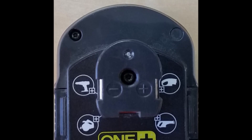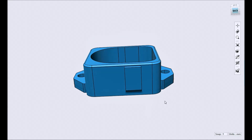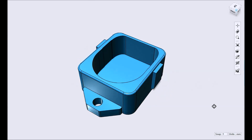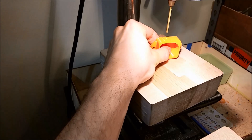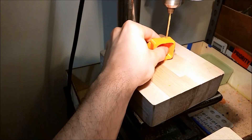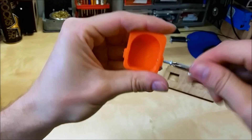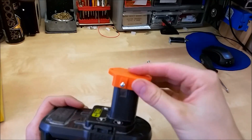I started by taking a photo from a top-down perspective, dropped that into a CAD program, and drew around the battery connector to scale. I took that 2D drawing and extruded it to a 3D model. Tapping into the battery's terminals was done by drilling a small hole and using a number 4 machine bolt screwed into the sides. The screw would be self-threaded into the smaller hole, giving me room to adjust the contacts to get to the battery's positive and negative terminals. That was the hardest part.